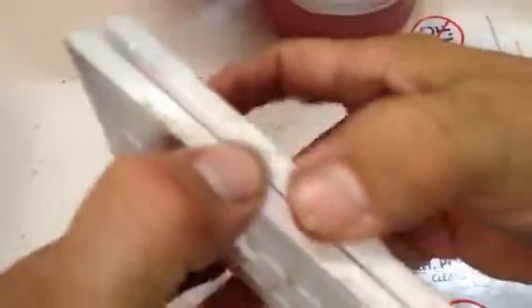On seriously acid-eaten tubs I recommend a spray-on primer. If you look at an acid run and see these little vertical serrations on a bathtub, if you just use a wipe-on primer, you lose that wetting on a really deep gouged or over-etched surface, because the product needs to wet. That's why you've heard people say silanes work better on smoother surfaces — they wet better, like slides you can't pull apart. If you've got deep serrations from acid runs and just use a wipe-on, you get a little pop-pop-pop when it hits those serrations, like a postage stamp — it lets go. A wipe-on primer helps as an adhesion promoter, but it's certainly not a panacea or cure-all.